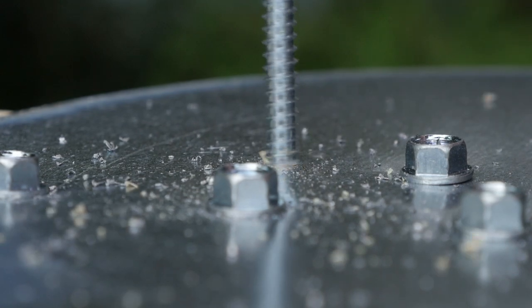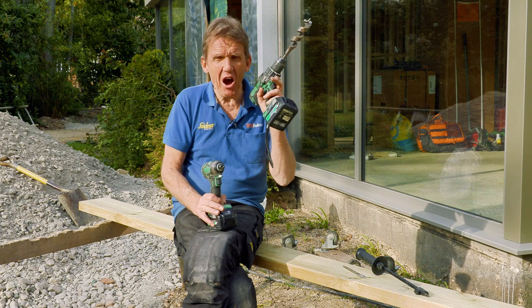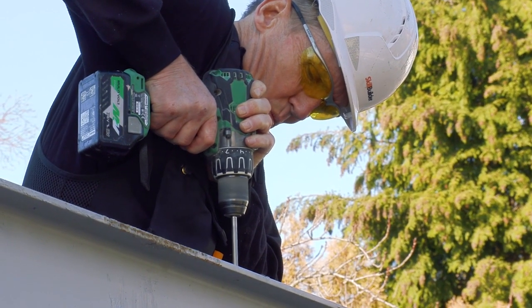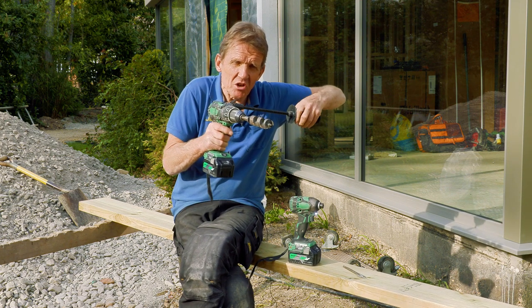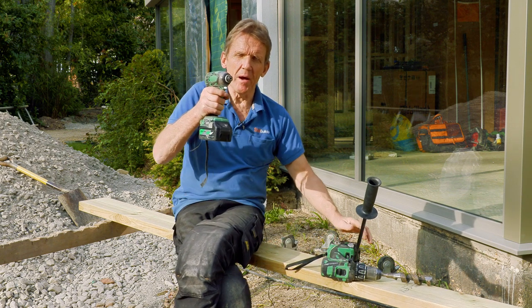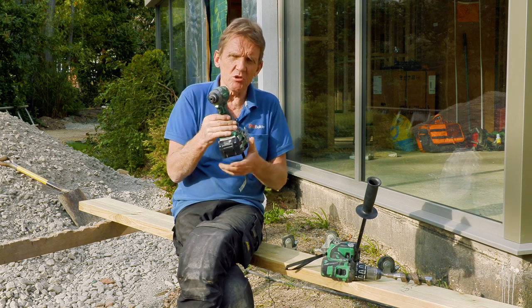From a user's point of view that means you don't have to worry about holding the thing firmly against the force of the drill. You can hold that with one hand and it will tap tap tap around and produce that high torque. Interestingly, we tested both of these machines and a lot of other makes as well, and we found that for ultimate torque the more powerful combi drill would actually drive a screw in further than the impact driver, simply because it's such a hugely powerful machine. But in order to do that you need to put the side handle in and hold the thing very steadily, so you need to be strong and really know what you're doing. Whereas with the impact driver you just push on the back of it and it will drive itself in, so it's a lot more convenient for a lot of people — it's really horses for courses.